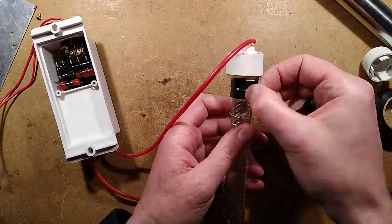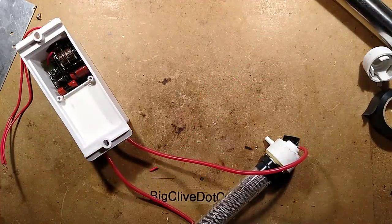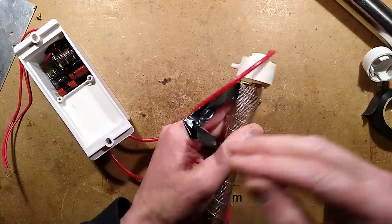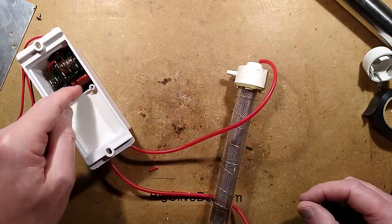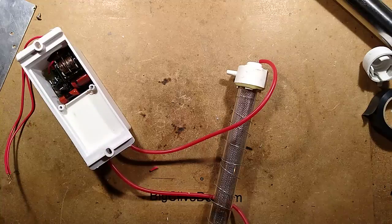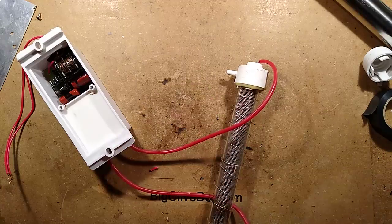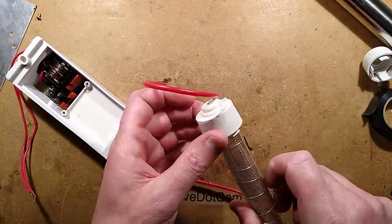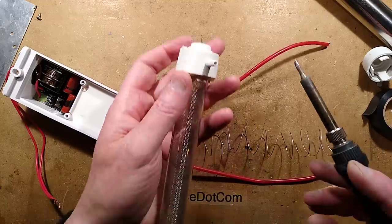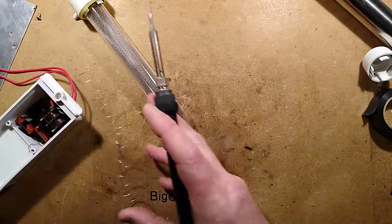It was quite parpy and buzzy. That's a very spiky bit of power coming out of that — it's not got the smoothness. The power supply is very spiky. I get the feeling it is a capacitor being discharged through a coil, done to make it cheap. With a neon-type transformer I would expect maybe something like a Royer oscillator — push-pull, better quality. There's too much risk that some electronic power supplies do not like being put across spiky, jabby loads.